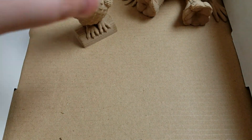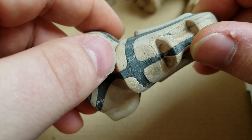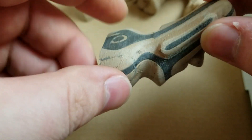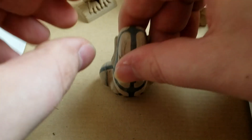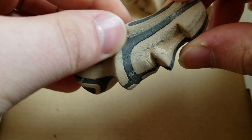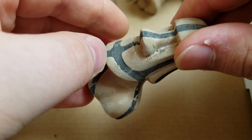I have another one here that is worse in some ways but better in others. This was printed with a dual extruder on my FlashForge — it's a mix of Hatchbox wood PLA and Proto-Pasta rustable iron PLA. I didn't rust it. The problem with dual extrusion is that you get a lot of oozing from whichever extruder is not being used, so you create a wall around the part as it prints vertically to help with the oozing. But still some of it gets into the print, so I did have to sand it, which made it not as perfect as it could be.